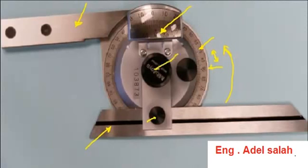We have a lock nut here, so if we unlock this nut we can then swivel the blade, swiveling the main scale to whatever angle we require. Then we can tighten it. This is a fine adjusting wheel, so once the lock nut is unlocked we can use this to dial the angle in to whatever degree we require.